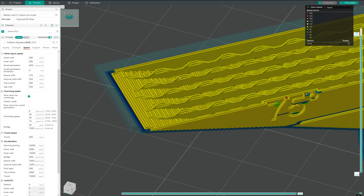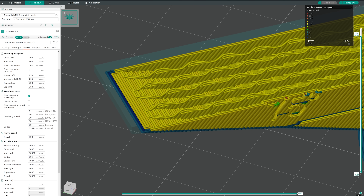This was easy enough to fix just by changing your bridging speed, but then all your bridges would be printing way too slow, and even the layers that go right on top of the infill would print way too slow and your print would take a lot longer. So thankfully now that this bug is fixed we can actually do a true head-to-head between the Prusa Mark IV S and the X1C. Let's talk about how we're going to test this.